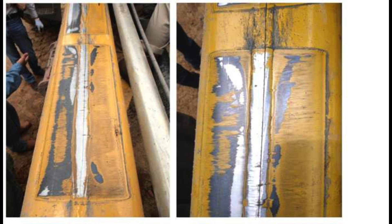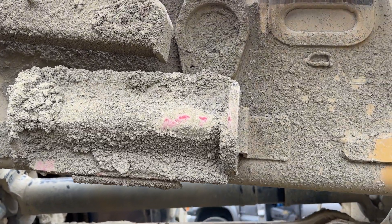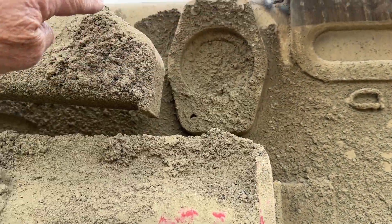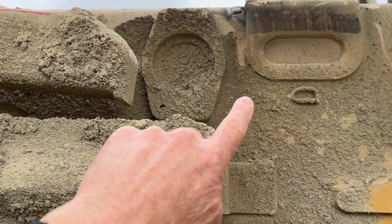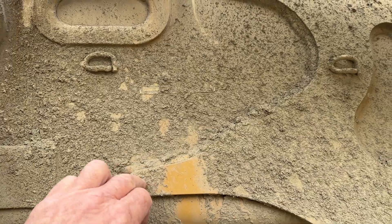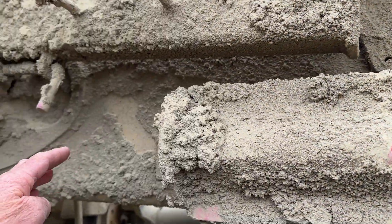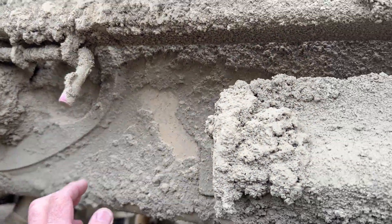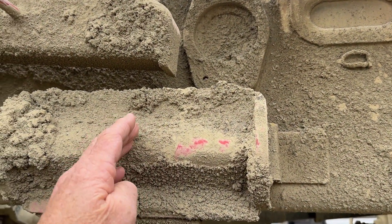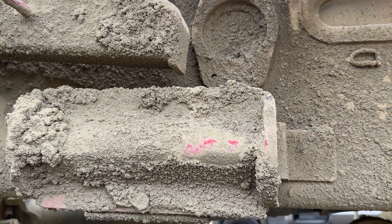This is where the two frame rails are butted up against each other and welded along the seam. We just had to cut it out and weld it back up. I've seen other trucks where guys plate right here just to reinforce the frame. It comes off this gusset here, and this gusset should have been extended all the way to the next gusset — then the frame would have been fine. But this is just a weak point on the CAT 740s. I think they just hauled too much weight for how they designed this frame.